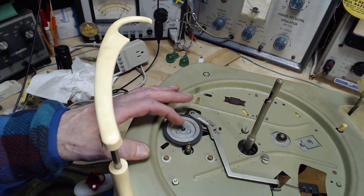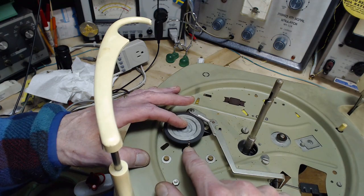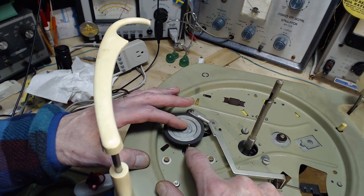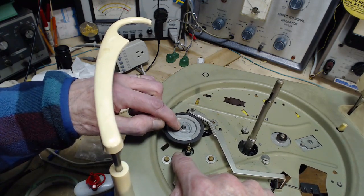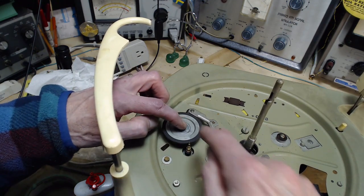Things are out of sorts. Some of these settings, it'll be touching the proper diameter here and rubbing against this down here, and that causes speed variations. So the height of this is very important. The precise height can be adjusted with little washers above and below here. So now we need to know if this rubber is good.